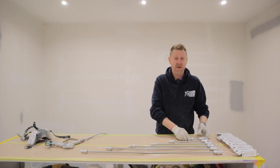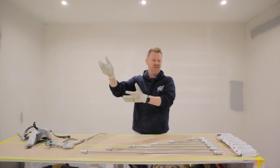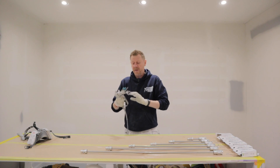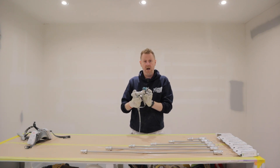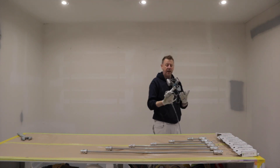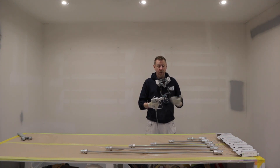Would I use the small one? Yeah, maybe sometimes for woodwork. We're spraying emulsion at the moment. It is cold here today so we've got a little bit of tailing — that's not my issue. I'm not worried about what the paint looks like to a certain extent. It's a 315 tip and we're going to start just with the gun on its own because you're going to be using this a lot. That for me is pretty much what my gun looks like most of the time anyway because I'm usually running a clean shot. So what we're going to do is give this a go first — just to make sure that obviously we don't get any kind of leakage or any kind of problems.